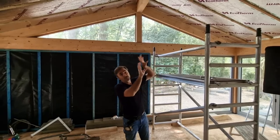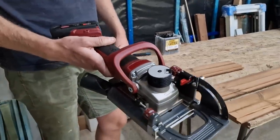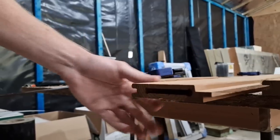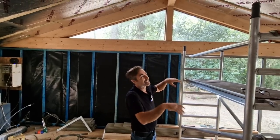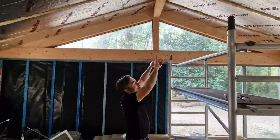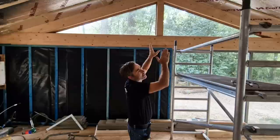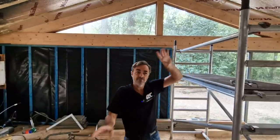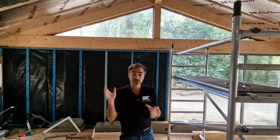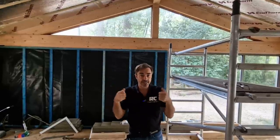Then we'll be putting the thermowood cladding over the top, and we'll be connecting this with the lamello, which is a brilliant plastic clip, which goes into a P groove, clicks together, locks together. That means that we can get a much better yield out of our cladding. Instead of cutting them back with the lamello, we can basically use the offcut and start, and then use a full one, offcut, offcut again. So we don't lose any material and the joint will travel down the roof at an angle, in a uniform pattern, and it will look really nice. The reason we can do that is because it's tongued and grooved, so the edges are supported top and bottom, and you've also got this lovely connection on the end.